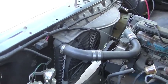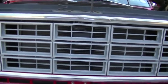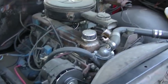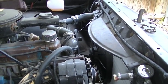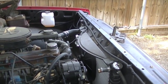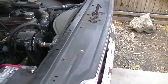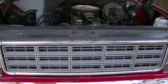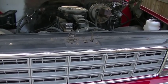With the current setup, it cools just fine up to an outside temperature of about 80 degrees. Once the temperature gets above 80, I start having slight overheating issues when stuck in traffic or in a drive-through. Here in Dallas, August temperatures can easily be above 100, and then it really starts having major cooling issues. As long as I'm moving I don't have problems, though when it's 100 plus degrees, even moving, the truck could still run a little hot.